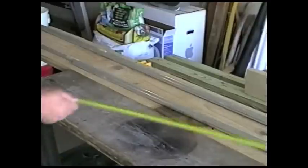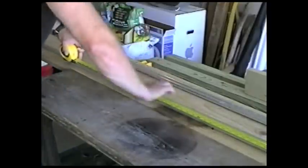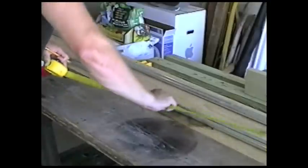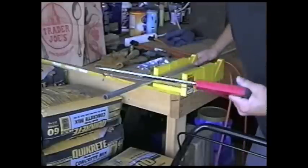The 1/2 inch electrical conduit comes in 10-foot sections. So I'm going to cut a 78¼ inch piece out of one. In fact, I got one here that's only about 8 feet. I used part of it for something else. So I'll take it out of that, and then we'll use the other two full 10-foot sections and start putting it together. Okay, just a simple hacksaw.